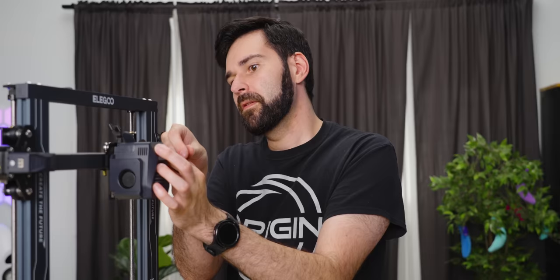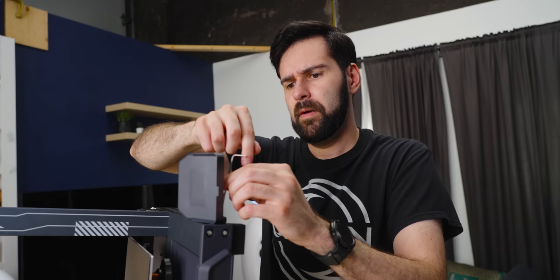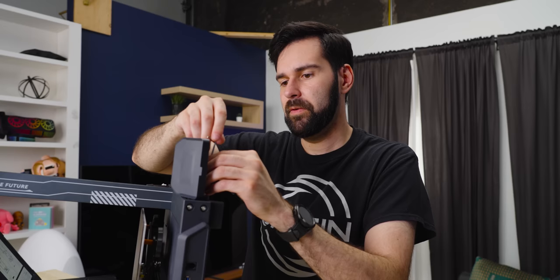It's not a tool-less shroud, but it is a two-screw shroud. We've got three little tapped holes here, which is nice. Everything seems to be going into metal, which is really cool to see. This is obviously a plastic injection molded part, but the screws are going into metal — there are heat set inserts embedded directly into the hot end assembly. This isn't a cheap printer, but it's a cheap printer, and I don't know how they do that. I think maybe they have the manufacturing capability to go full bore into super mass production and make 200 billion of them, and then they cost nothing each.